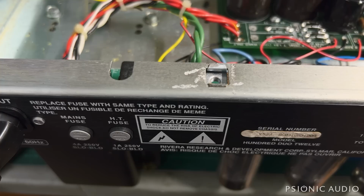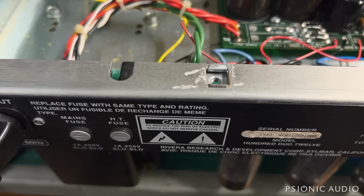There seems to be a relatively high noise floor. It could also be tubes. Let me plug into the effects return and see if that makes any big difference. See, we have a hum plugged into the effects return. And I had the return level at 1, the minimum. Now I turn it up.